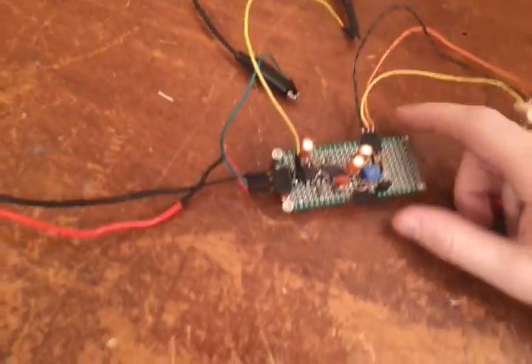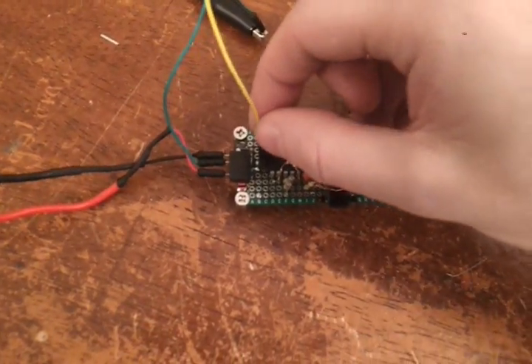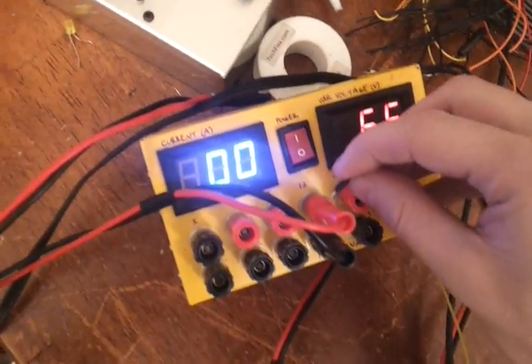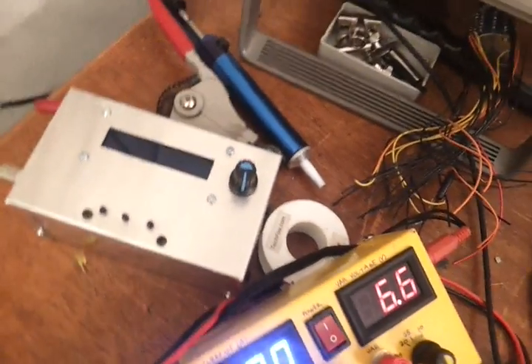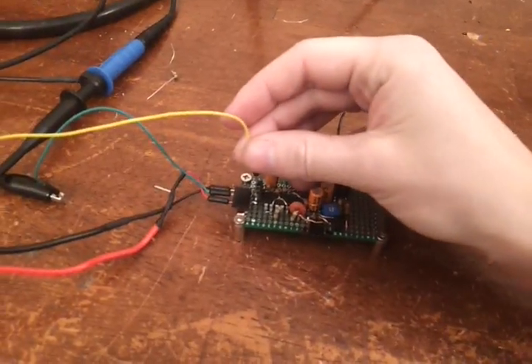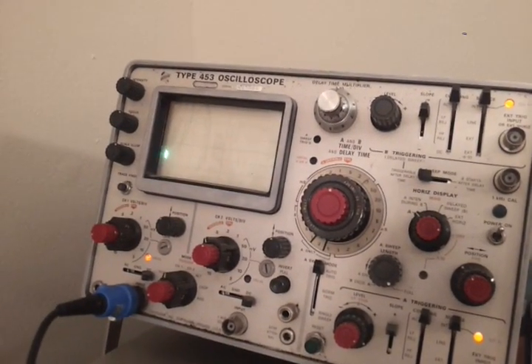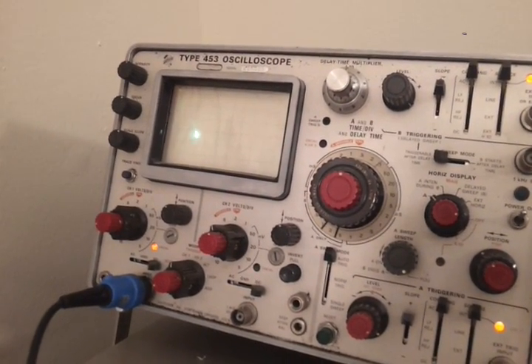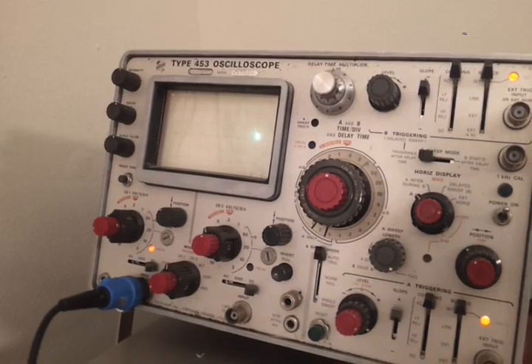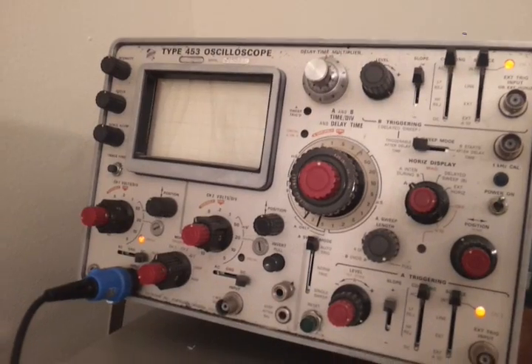To show you what I mean, I have the output graphed on my oscilloscope. I collect the output here and this pin is going into my oscilloscope. When the probe is at 0 volts it's at the bottom, and when I move it to 12 volts it goes to the top of the screen — so top to bottom is 12 volts. Now I plug this into the output of the board, and it takes just a fraction of a second to equilibrate. That's the output — we get a full, probably 10-volt swing corresponding to the heartbeat. There's a relatively small amount of 60 Hz noise; the biggest problem with these simple amplifier circuits is noise from 60 Hz wiring in the wall, but as you can see it's working pretty well.